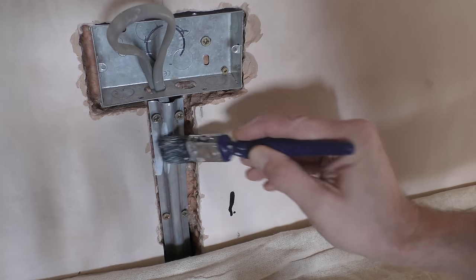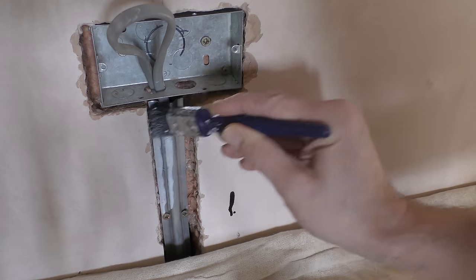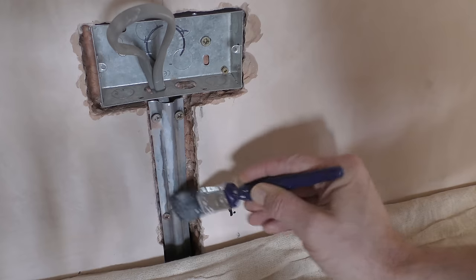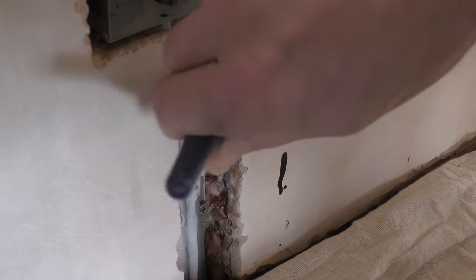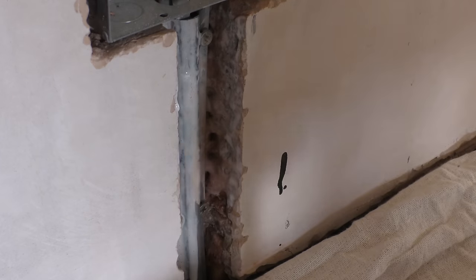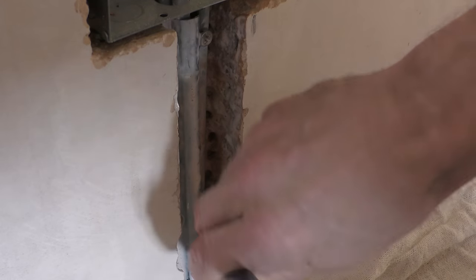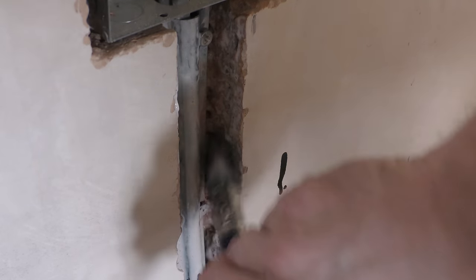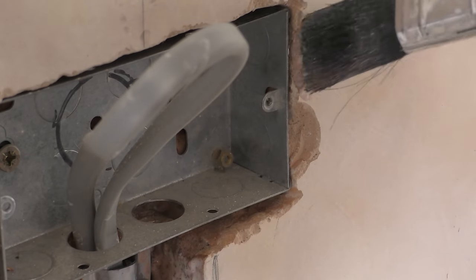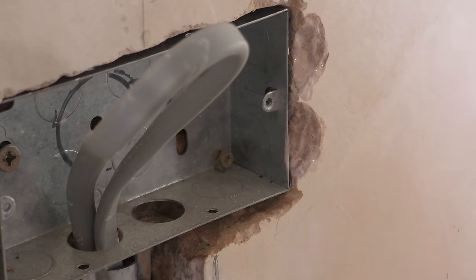That's our mixture — as you can see it's quite a watery mix. We're just putting the PVA onto the brickwork because even though it's been well vacuumed it still has a dusty surface. The watery mix is quite good in this situation because if you didn't dilute the PVA enough it might not actually sink into the bricks properly. We're also going to repair the plasterwork at the front, which was slightly damaged when I cut in for the new electrical back box.